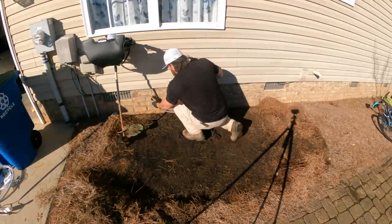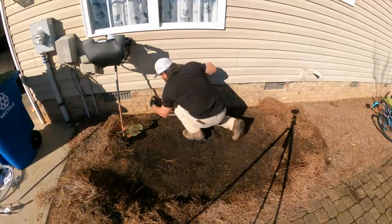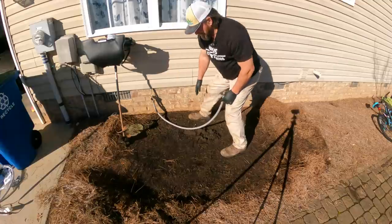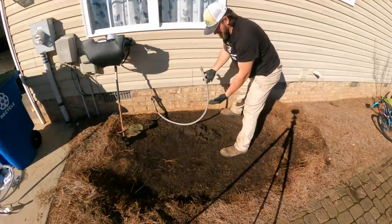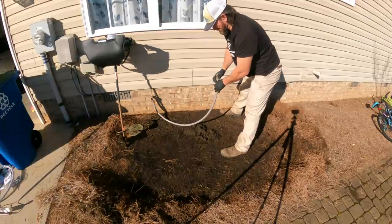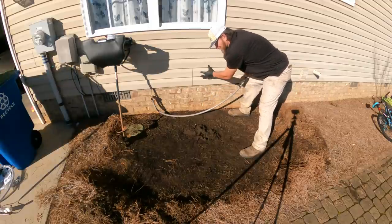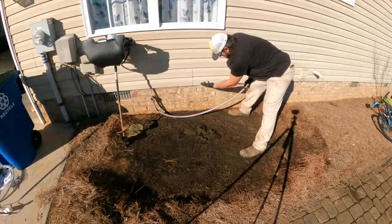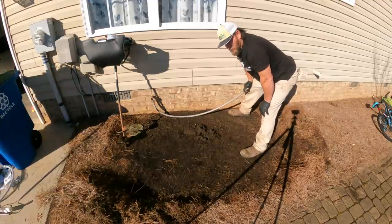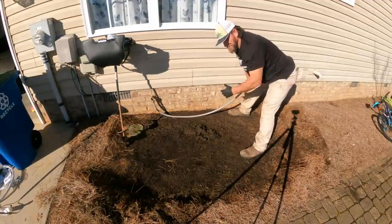So what I'm gonna do right here is take my leader hose and hook it up. I did my measurement going to the furthest part of the yard from the actual water spigot. If I move it a little bit either way I lose a couple of feet, which is why I added that 10 feet of buffer. I know I've got plenty of room to mount it right here. I could mount it on the wall — they have a wall mount option — but I can't mount it down in the concrete, and I honestly don't want it on my wall. So I got the post mount, and I've got a four-by-four post that we'll set right here in the ground, anchored in with some concrete, and then mount the reel to the post itself.